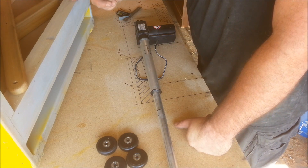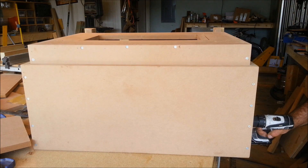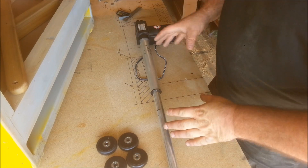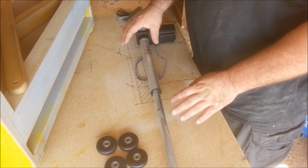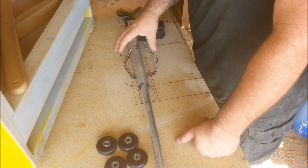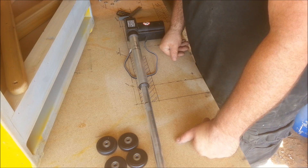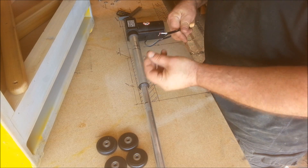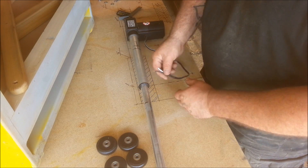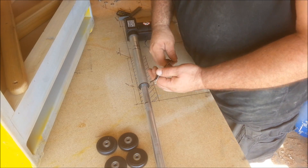Let's take a look again at how that drill worked. Now we're just going to use this linear actuator instead. I got this off eBay for 30 bucks — this was a lift for a wheelchair lifting device on a vehicle and it's a 24 volt system. So I got a 24 volt power supply and I ordered a reverse polarity switch that's not in yet, but we'll just make do until it gets here.